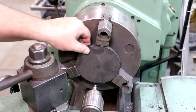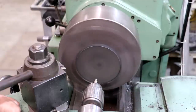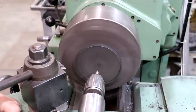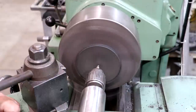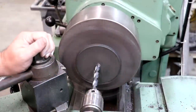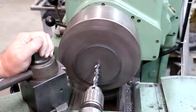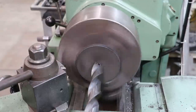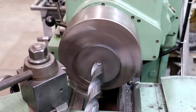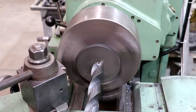I'm going to start — I've got my plate over here in the chuck and we're just going to drill a hole in there. I think I'm going to go with an inch and a quarter hole for that arbor to come up through. Start with a center drill to give me a little dimple right in the center of the part. Now I'll change to a half inch drill bit to get a hole started, then slow things down and put in a larger inch-and-a-quarter drill bit and run that through there.